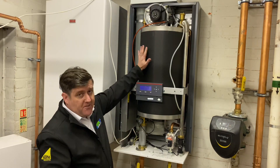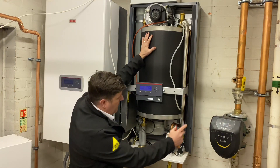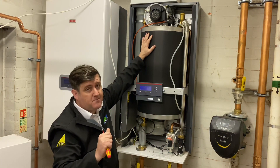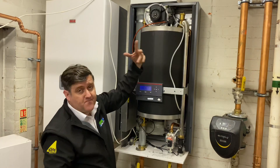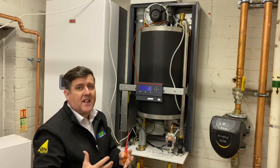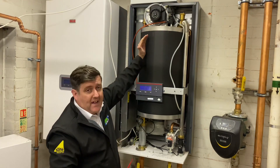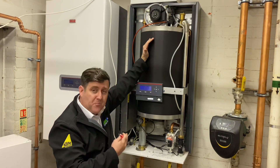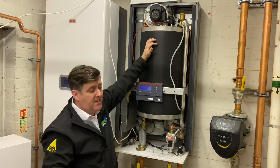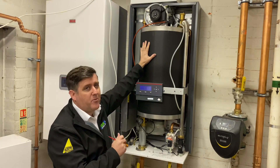Our reason for using these boilers is because they use a stainless steel heat exchanger and we've basically got a one inch diameter pipe coil. On older systems where the water quality is not as good as you'd like and there's a lot of iron pipework, the water gets through this boiler really really well compared to some aluminium heat exchangers where the waterways are a bit more narrow. These are fantastic and they are really really powerful boilers.